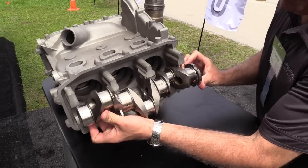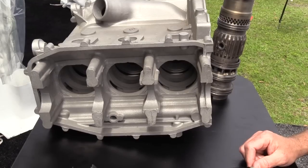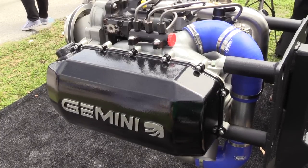This engine is a two-cycle engine, which makes it very smooth and very efficient. It requires a supercharger to establish flow through the cylinder itself, because from a pump perspective, until combustion is started, airflow is not established.